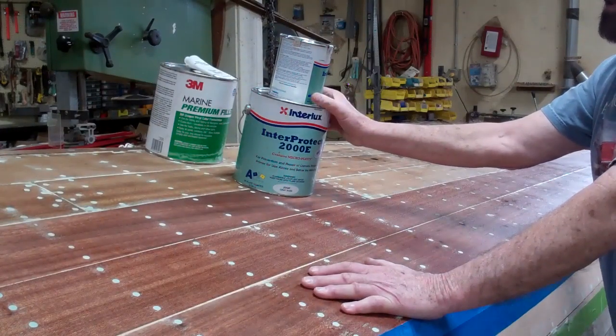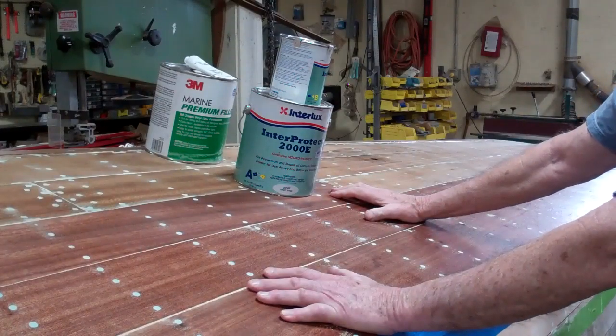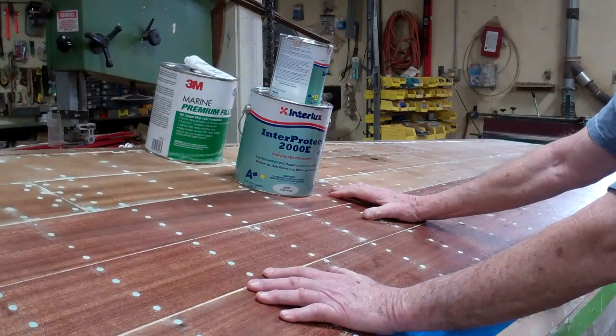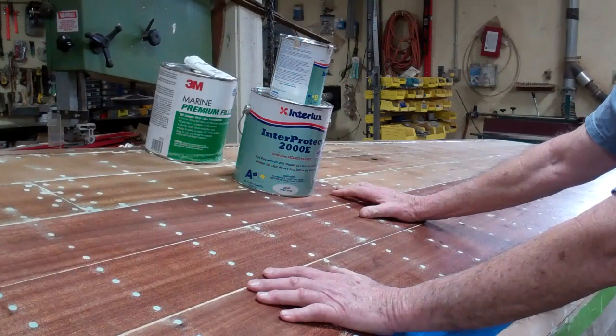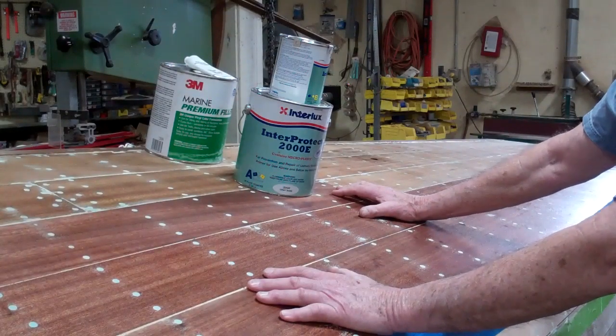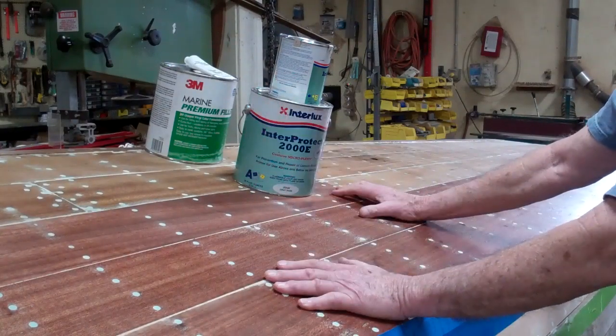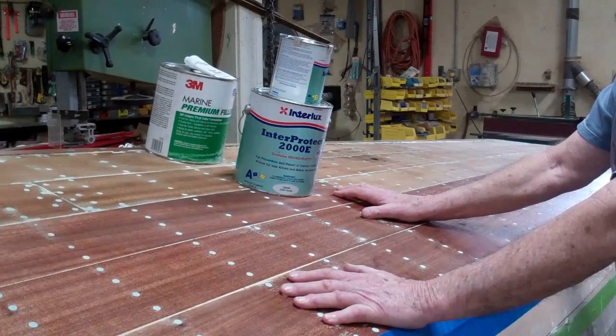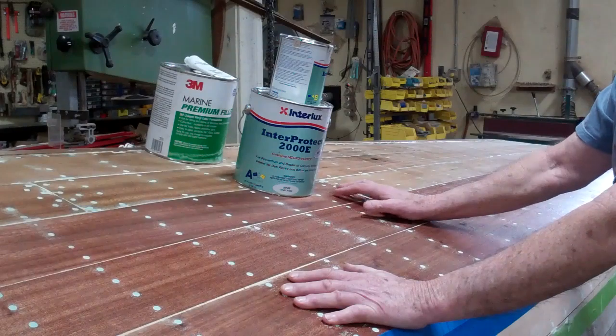Once that's done, then we'll reach for a gallon of Sandusky copper bronze hard racing bottom paint. That paint is not for a boat that's going to sit in the water and destroy itself all year. Those of you who sit your boats in the water all year, well, it's your choice. Those boats weigh 50% more in the fall than they did when you launched them in the spring. And the rot's beginning, and the rot's growing. But be that as it may, then we apply three coats of the hard racing copper bronze bottom paint. And at that point, we have her ready to flip and ready to work on elsewhere.